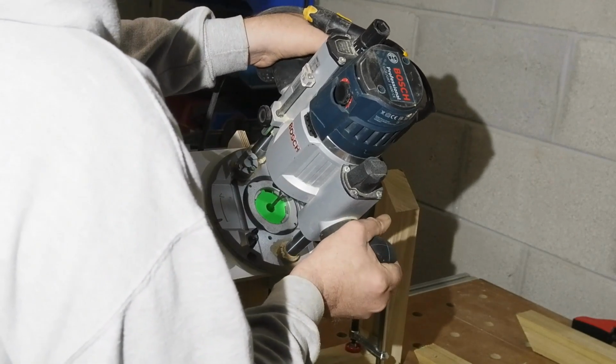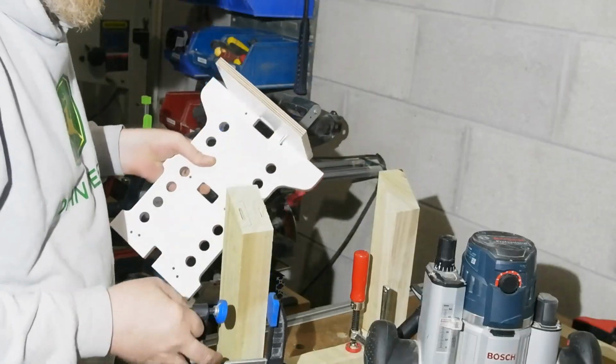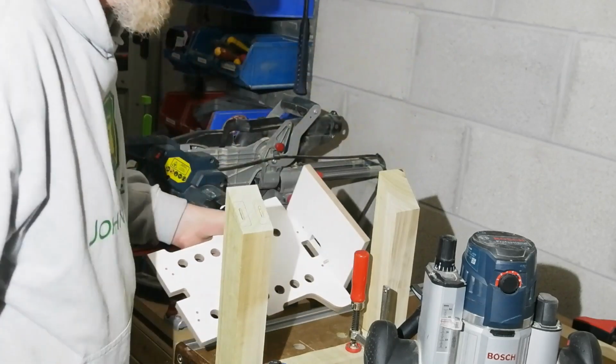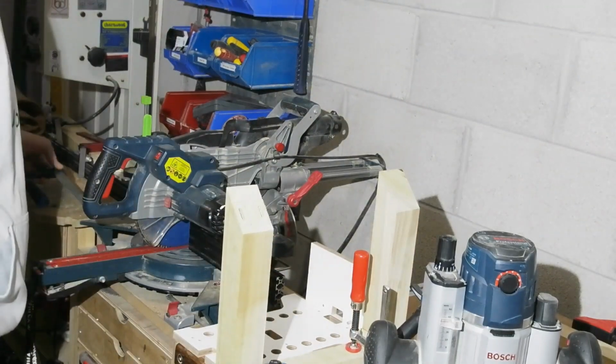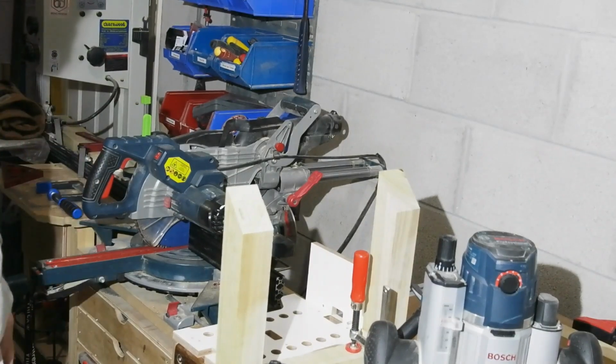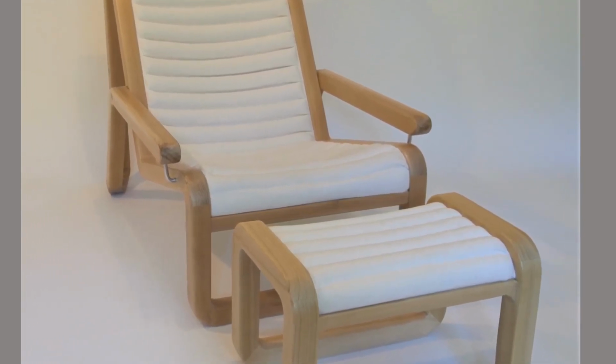I don't have a Domino, but I do have Peter Millard's 10-minute workshop loose tenon jig, which will do what I need. But with my setup, it only works with my big router. Not ideal, but I'm getting a loose mortise plate for my copy router to make this easier and for my more appropriate 12x36 tenons.